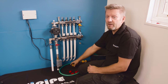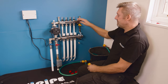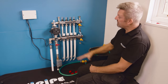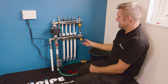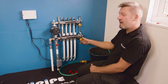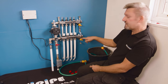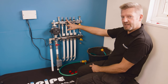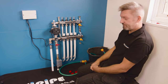When it comes to filling the system, it's very important that we fill the water in at the top and vent the air out the bottom. The reason for that is the way the flow meters act — we need water to go over and push down. If we try to push water in from the bottom and vent out the top, you'd be pushing the flow meter against its seating. So we're going to attach a hose pipe to the top port and put the other hose into a bucket so you can see the water and air coming out. Once we've filled the first circuit we'll turn it off, open the second one, and work systematically across the manifold until all loops are filled.